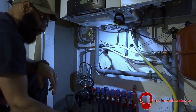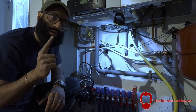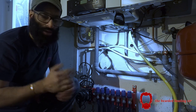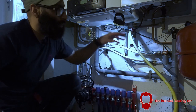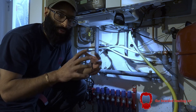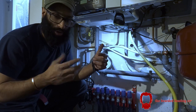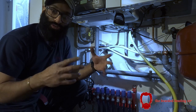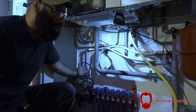That's that done. So just to recap, all the radiator valves have now got Tado on them, except one, which is in a closet, which is going to act as a bypass. That closet isn't a usable room, and the customer's happy to use it as a bypass, because the little bypasses you fit under the boiler and stuff, I personally don't like. When you've got full electronic radiator valves, such as Tado, Honeywell or Evo Home, I always prefer a radiator to be a bypass, because there's more flow of water through it, and this reduces the chance of overheating of the boiler. So, zone valves fitted, all the radiator valves have been fitted, and now we've got to just wire it up.